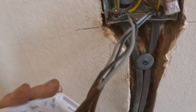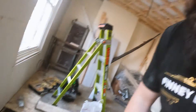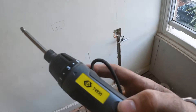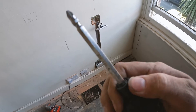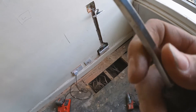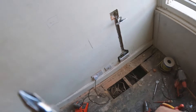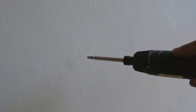That's the intermediate wired then — browns in the back just put together, black and grey on the top, black and grey at the bottom. That'll get tucked in nicely. CK sent out this e-driver — it's got a torque setting, you can pick the newton metres you want up to six newton metres. You can swap out whatever attachment you want — it's just a hex like a normal drill. Perfect for getting things nice and tight inside the fuse board at the perfect torque setting.